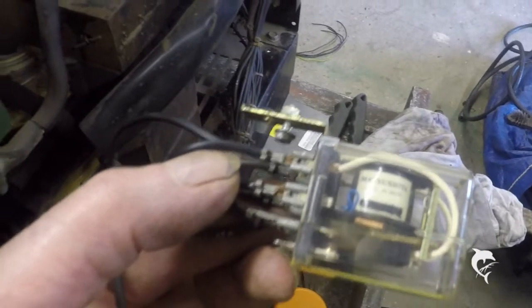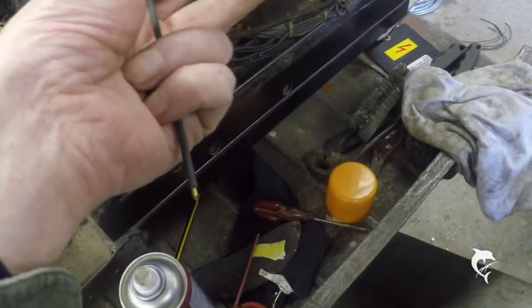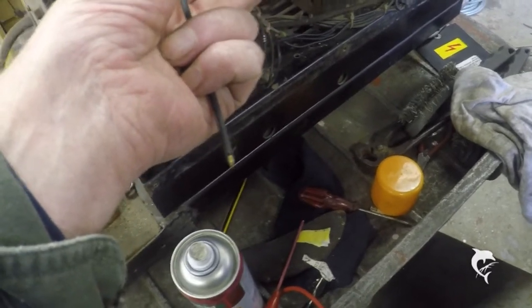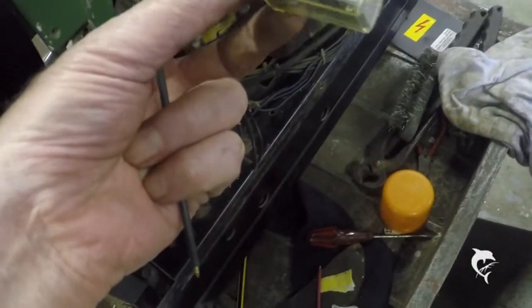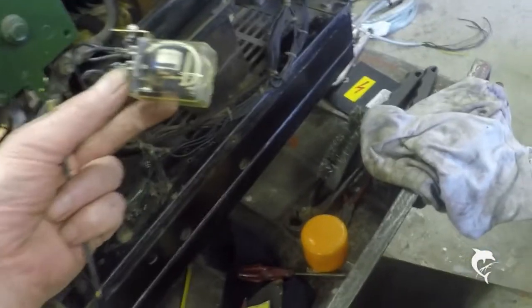The contact is working. But another thing I've just looked at here is this little relay. Now the purpose of this relay is to operate the gas valve and the HF start when you're in TIG mode, because this welder will also stick weld. But in TIG mode, this little relay clicks in and out as you click the trigger switch. And if you look carefully on this relay just here, you can see there's like a brown stain. I hope you can see anyway.